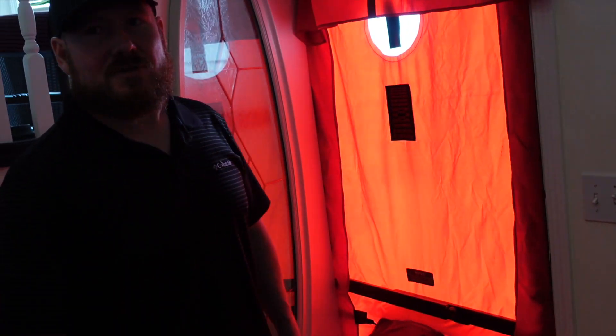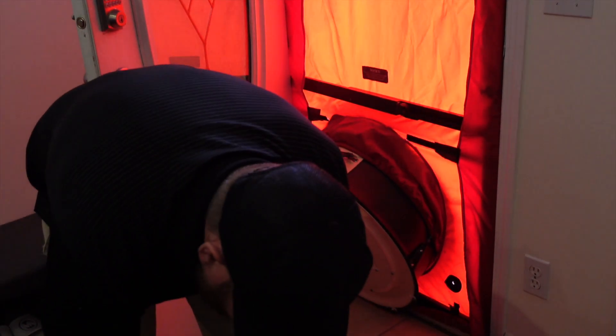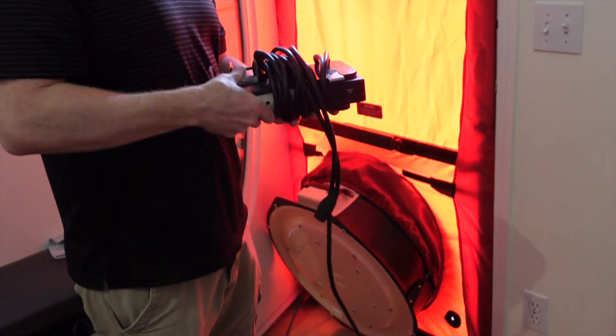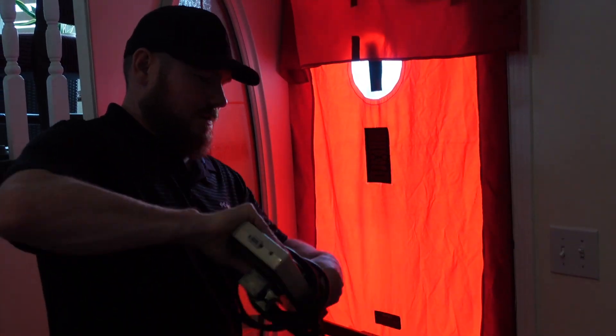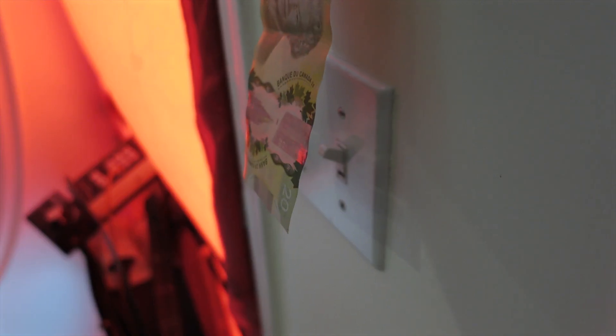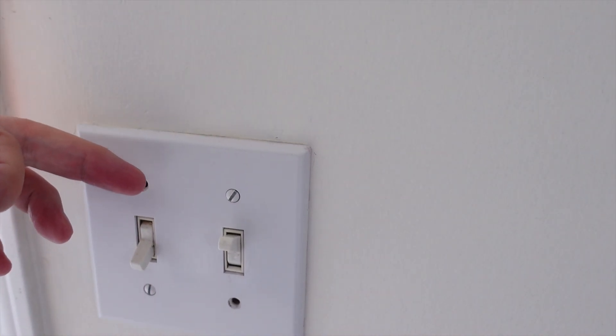So the blower is sucking the air out of the house. We'll be drawing outside air in through the cracks and crevices, taking 8 different readings at different pressure readings, and applying that to the heated volume of the house. That's literally just money getting sucked out of our house — you can actually feel the air coming through.